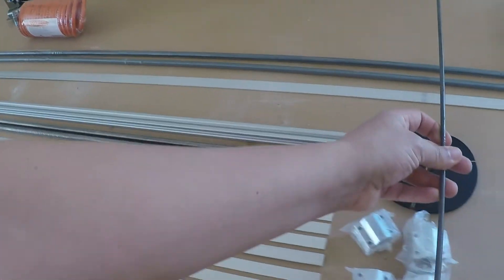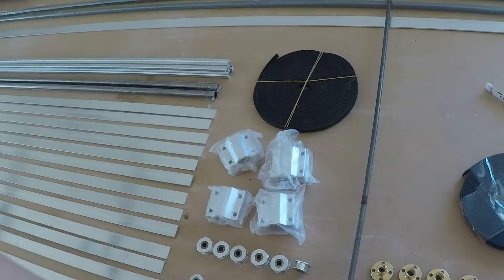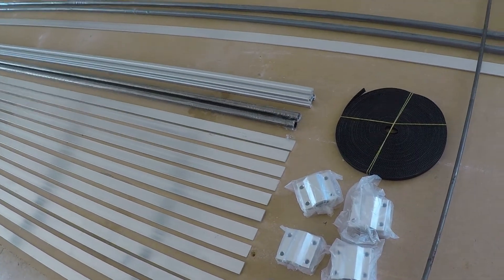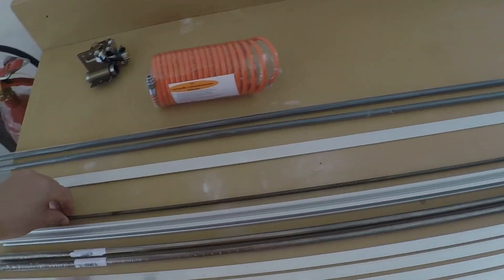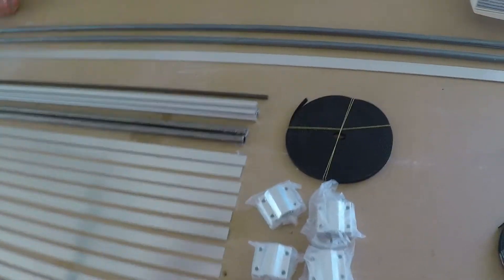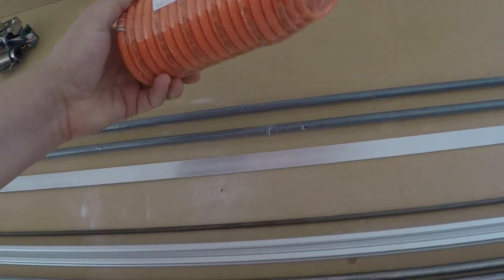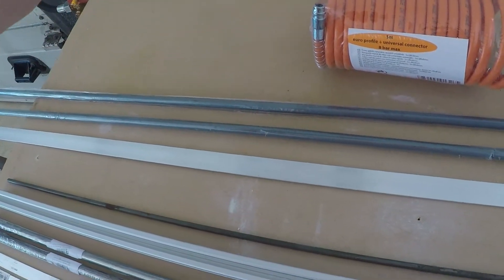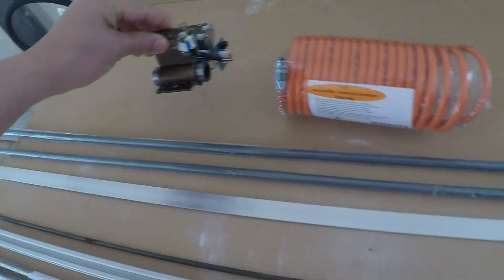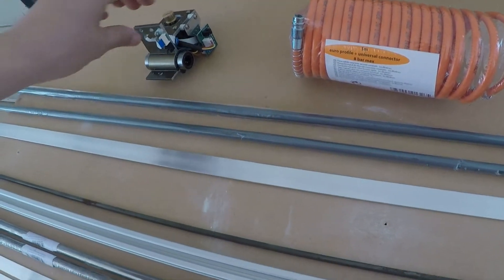This is a 5 millimeter rod to make the motion transfer for the X axis from one side to the other, because I will only have one stepper motor — so I will transfer the motion, just like on the small KX40. For the big rails I have solid 10 millimeter metal rods. This is for the compressed air, and this is the laser head assembly from the KX40 — I will make new parts to mount this on the KXL.